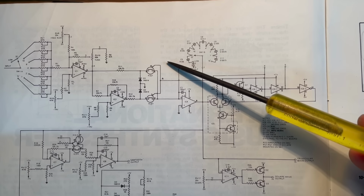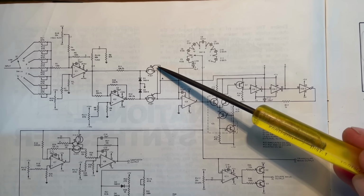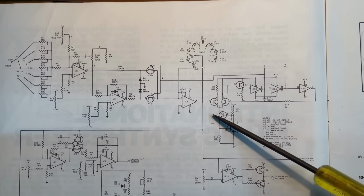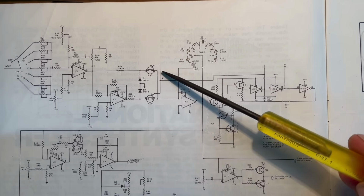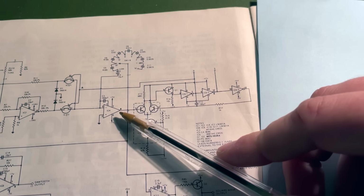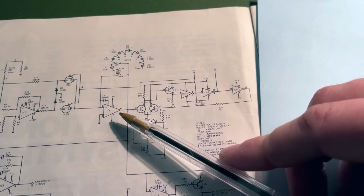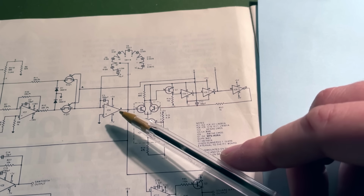So instead of it switching rapidly between low and high, it's smooth, it's over time taking longer to reach the low and then high point. So you can see there, as I'm drawing it, you're getting a triangle instead of the sharp square, okay? So this integrator here, built around this operational amplifier, is performing the mathematical operation of integration, and we're going to get into some maths, but it's actually quite interesting.